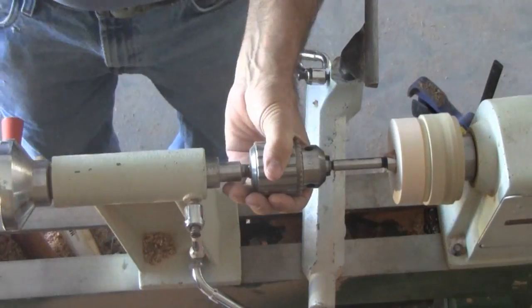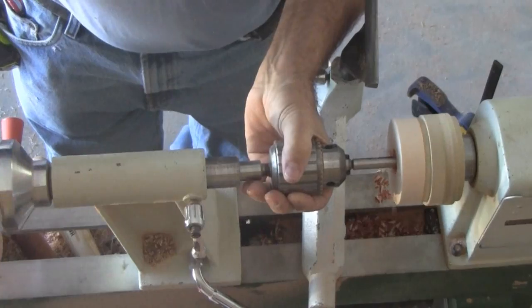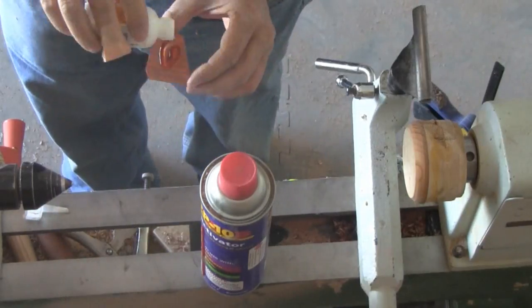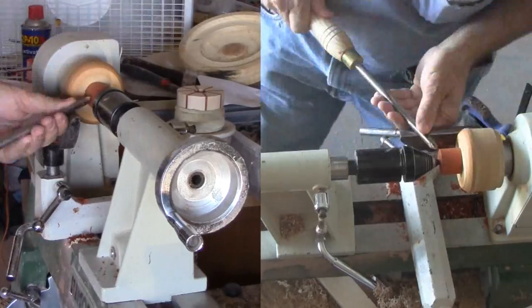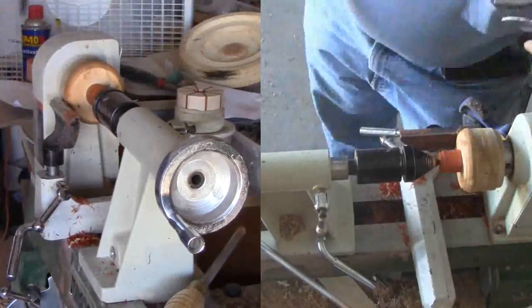First is some special attention to the top and bottom. I'm drilling out the very middle of the ring since the padauk pieces don't line up anyway. Then I'll turn a padauk plug for the top and bottom segments and glue them in place. As soon as the glue sets enough to remove the timber from the lathe, I'm swapping over to the other end on the other faceplate.